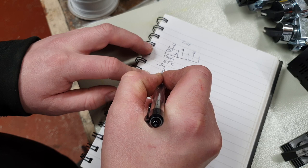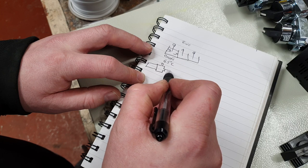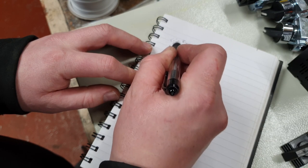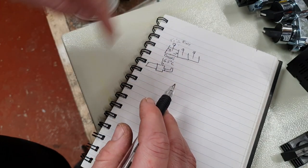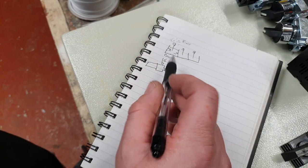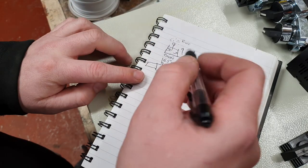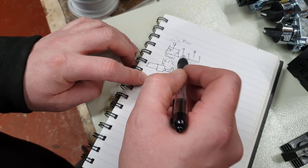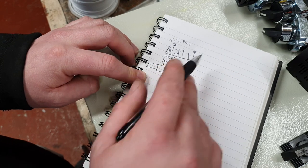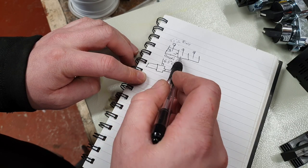All of these tanks, apart from the rinse tank at the moment, are powered by a pump. The pump sucks in the caustic from the bottom of the tank and spurts it out to the spray ball — it's a rotary spray ball — and it sprays inside the casks or kegs, whatever we've got. Then it drains out of the bottom back into the tank, so it's just recirculating that liquid. Once we've given it a caustic wash, we put it back on the rinse tank.